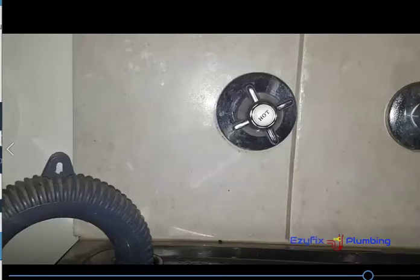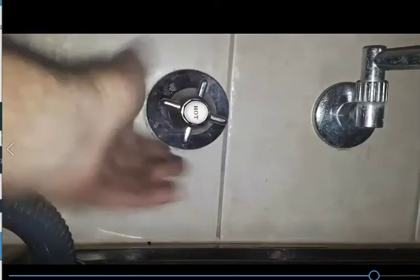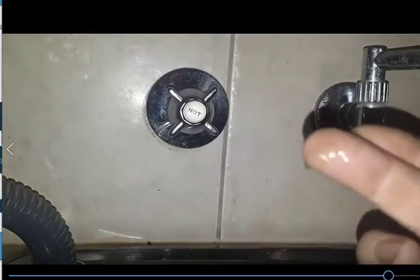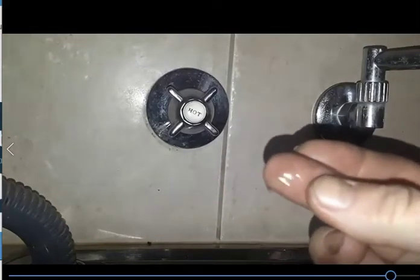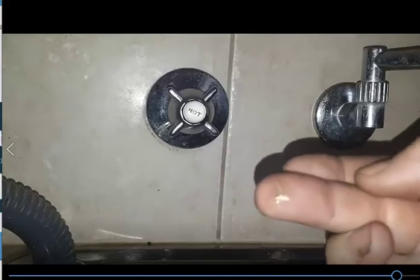So I'm going to go and turn the water on. Alright, water's on. All I'll do is just open up the tap washer flat out, open up the valve, then shut it off — just a couple of times just to get all the brass filings out from behind the seat. Once you've got that, you can see these brass filings just there on the end of my finger. Just one of those pieces like that gets stuck behind the tap washer and it'll just keep leaking.